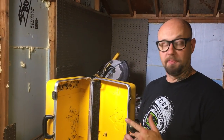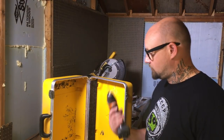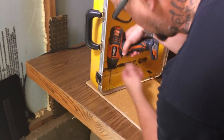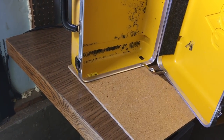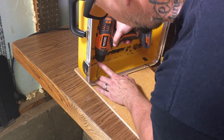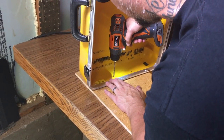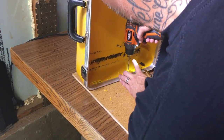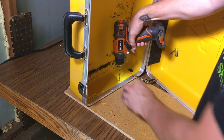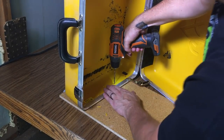I've put in the drill bit appropriate for my screw size — that'll vary depending on the screws you get. Don't go larger than the hole that's already on the bracket. I've got a piece of press board underneath so I don't mess up my table. I'm going to center the drill on the hole — that plastic drills through real easy. Depending on your material, you can also use a spring-loaded center punch to mark it first, and your drill bit will lock right into that hole.